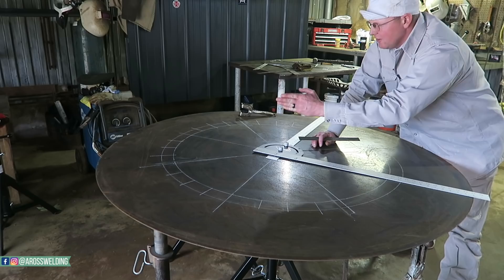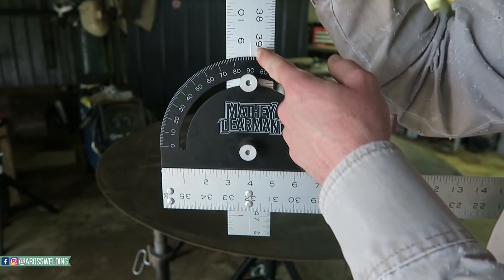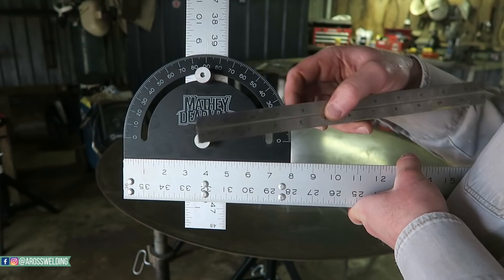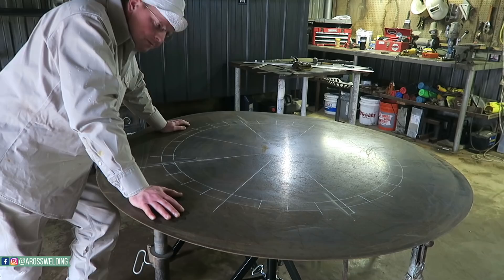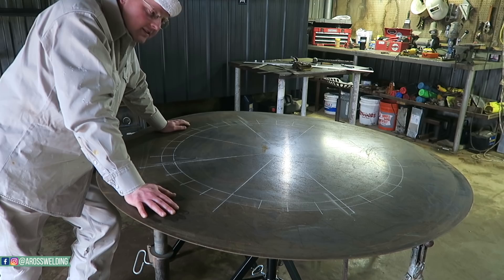Here's what I've been doing - you can see I've got all those broke down into sixteenths I believe. The way this thing works is you line up the tool with 90 and you've got zero here and zero here. You can't just mark on the side of the straight edge - you've got to mark where the zero is. So I took a one-inch piece from a combination square, laid it up against here, and marked on this side of it everywhere I turned it, so it'd be on zero. Now I'm going to do some more thinking, do some more notching, cut it out, and then go to breaking it over and see what it looks like.